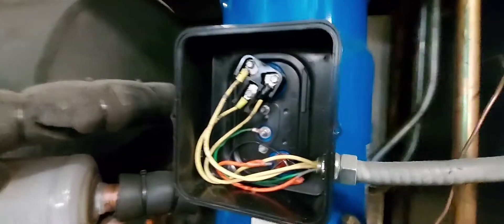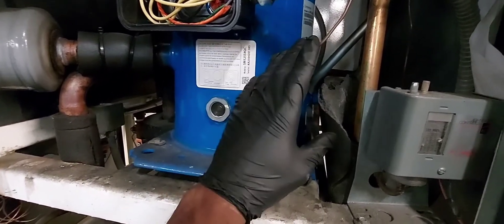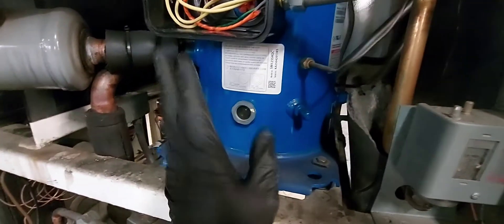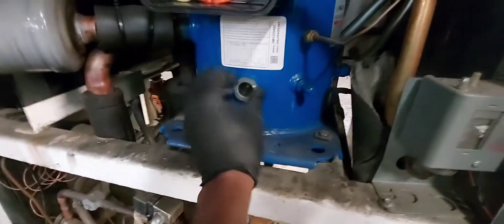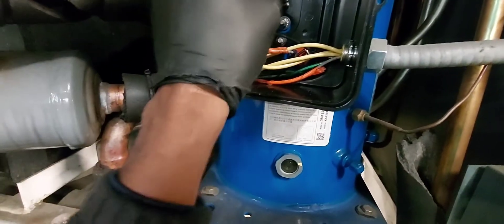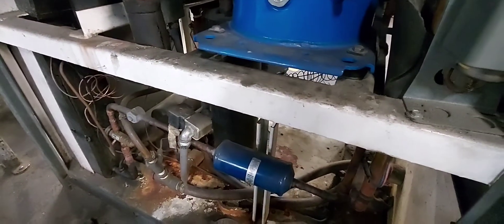When it comes to mega ohm readings, what we're really testing is the internal windings of the compressor's resistance against the ground. The copper pipe right here is grounded — it's connected to the compressor chassis ground. So we're testing the resistance of the internal windings against the ground. You can go to the piping, any metallic surface, scratch the paint off if you want — anywhere that's ground.